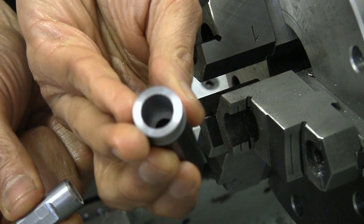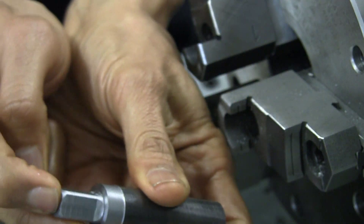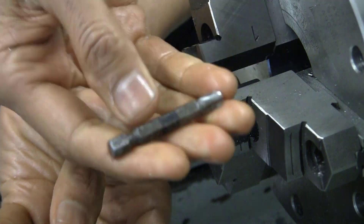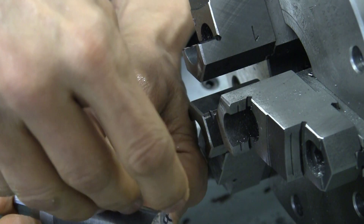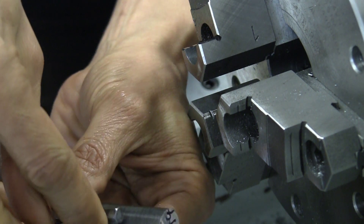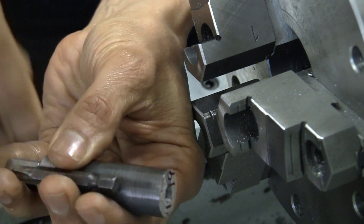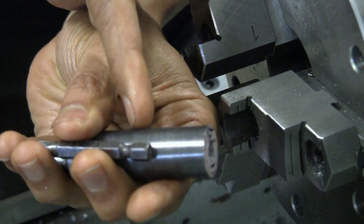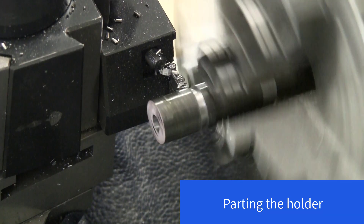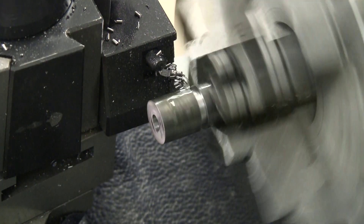Here's the holder that is drilled out half an inch on this end — this will go in there snug. This part will go in from the top down to about here, so I'm going to part the tool off right there. The exact length of the tool holder doesn't matter; its reason for existence is for aligning the hex bit.